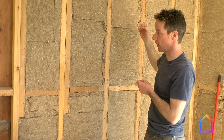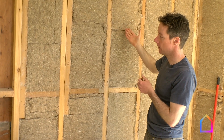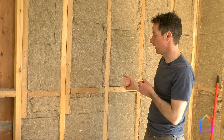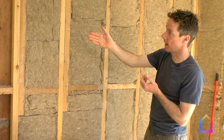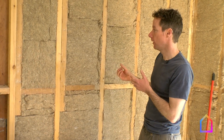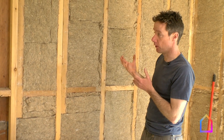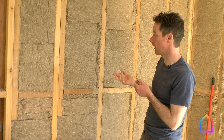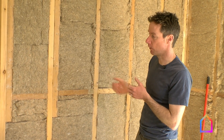But in very sunny weather, you can get something called reverse diffusion, where the sun shining on the wall outside drives moisture from the outside of the wall through to the inside. Because I haven't been in control of what the sheathing board was on the outside — since that's pre-existing — I want the wall to be able to dry out in both directions. So I'm using hygroscopic and vapour-open insulation, and then a variable vapour barrier so that it can dry out in both directions.